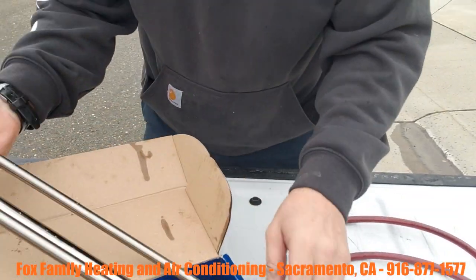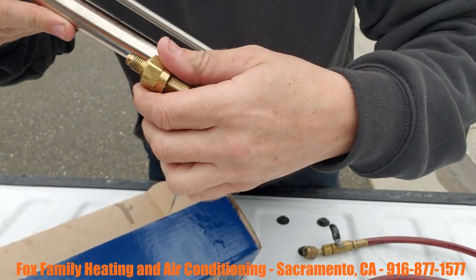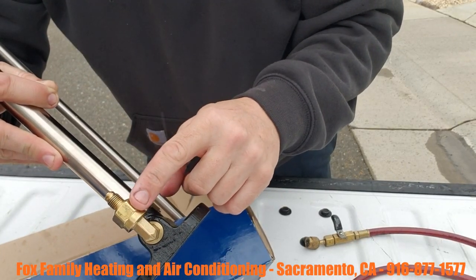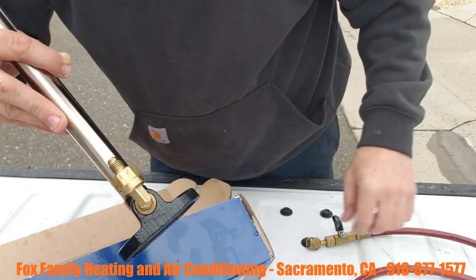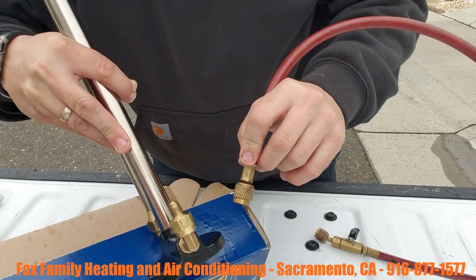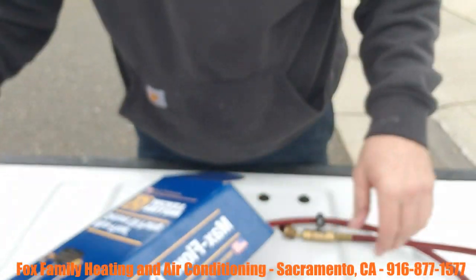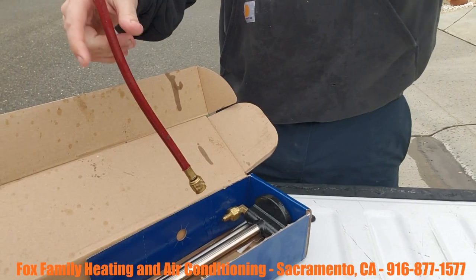Okay guys, just want to show you a little something else here. My friend Nate Hicks on YouTube and Facebook reminded me that this unit comes with just a 3/8" male threaded flare fitting on here. So we actually went and bought the 3/8" to 1/4" adapter — thanks to Nate giving us the heads up on that — and that really helped out because then I was able to screw my hose right onto the 1/4" instead of dealing with the 3/8" fitting. So you'll need to get that adapter.